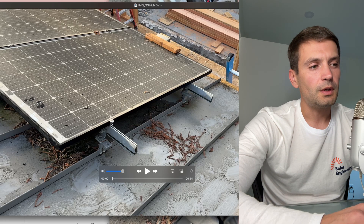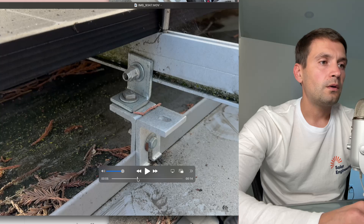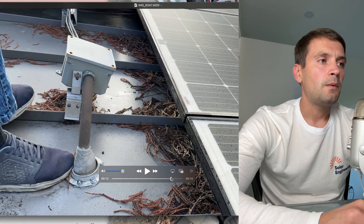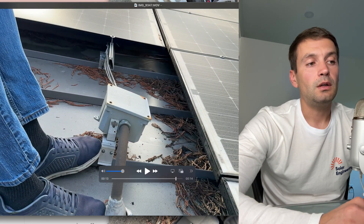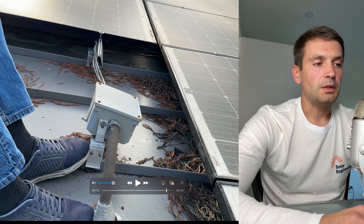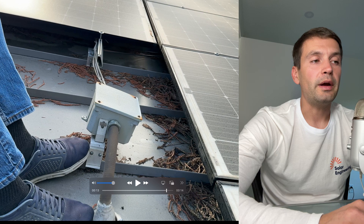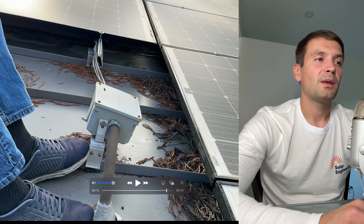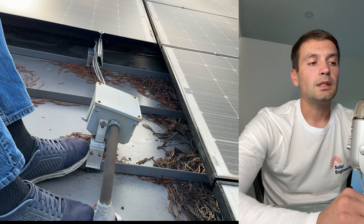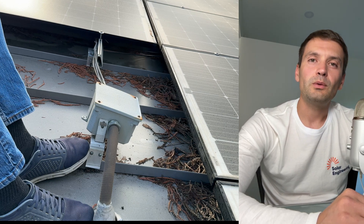In this video we can see that the clamp is holding as of now but it's bent a little bit, so it might fall off soon. For the junction box, same connection here — an IronRidge bolt on the L-foot holding the junction box, and all of those are PV wires carrying 240V AC, which of course cannot be used here. We can also see that an end clamp is missing here. If you're asking an installer to install a system, make sure they have the correct materials. Thanks for watching and I'll see you in the next video.